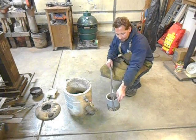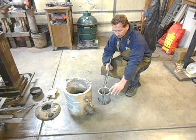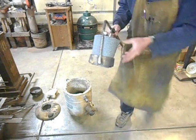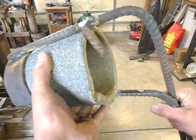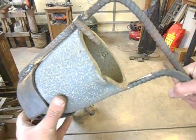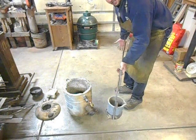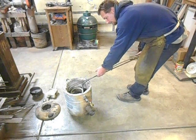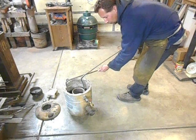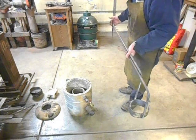This little part right here makes it so this can't come out, and you can see it's all loose — because apparently these crucibles don't like sideways pressure very much. So basically this whole thing is fit up to be a cradle. You can see that crucible has got an awful lot of wobble — it's not really being clamped, there's no pressure being applied to the sides. It's just holding it there. So once you get done with your pour, instead of setting it back down and picking it up with something else, you can place it right back down inside the foundry, turn it loose, disengage your lock, open up the jaws, and ease it on out of there without messing up the walls of your foundry.